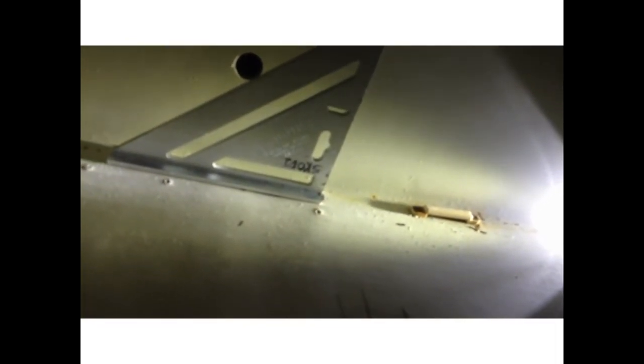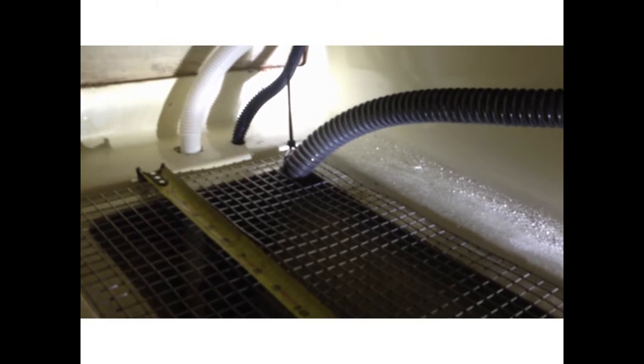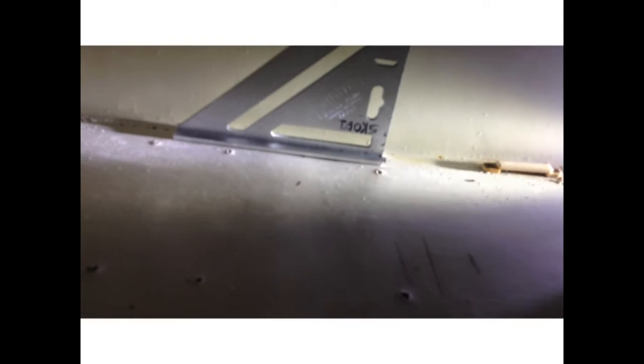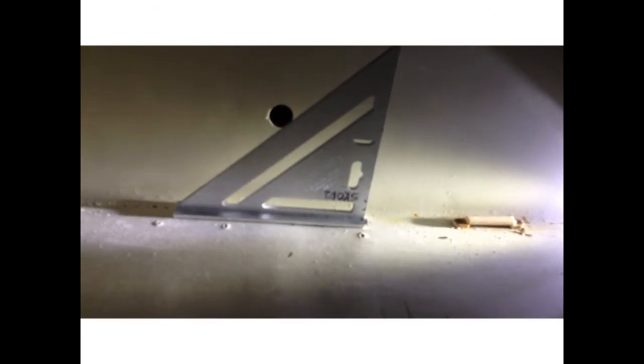Well, the 21 gallon's not going to fit, because where that angle is, that's the line where I need my cooler to fit underneath the forward cockpit step, and 39 inches is the length of the 21 gallon tank, and that comes all the way out there. So the 16 is only 26 inches, and the other plus is it would have to go all the way to the end, and I have to drill another hole for the manual bilge pump. So I think we're definitely going with the 16, and this way I'll still be able to get the bilge pump out, and I'll have plenty of clearance for the cooler, or if I make the ice box. So, well, I got that decision made. I can get the tank ordered tonight.